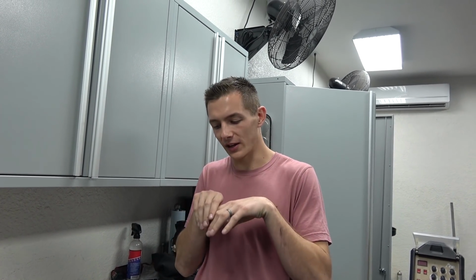I didn't sharpen the tungsten right. The tungsten was too far out, so it was splurging the gas everywhere. I had the AC on, which I shouldn't have had. And I was inexperienced. Well, you did really well.